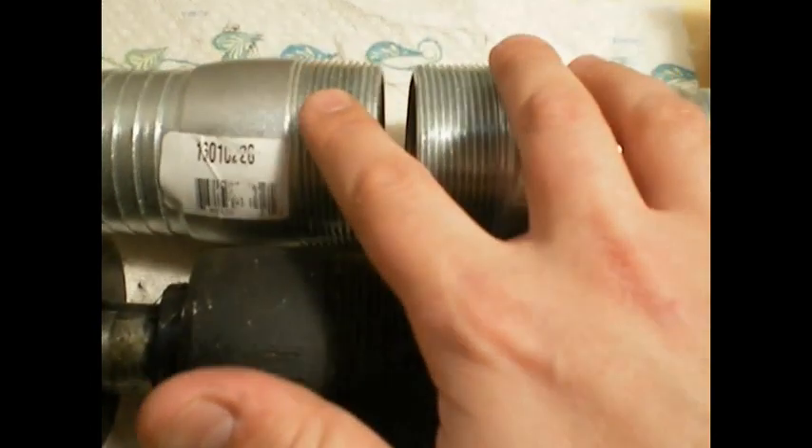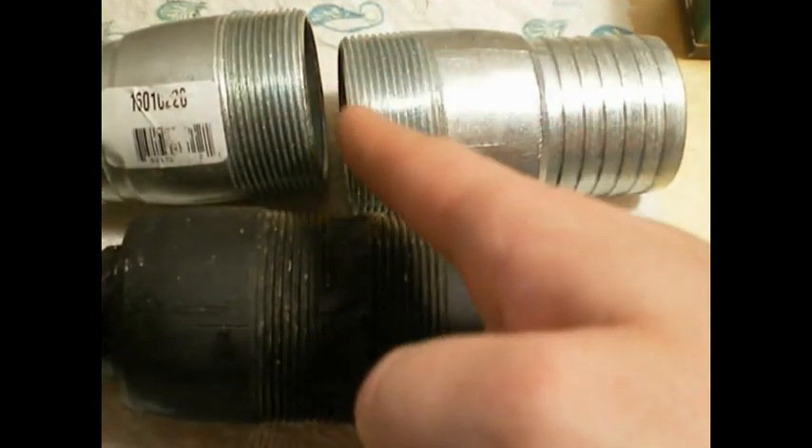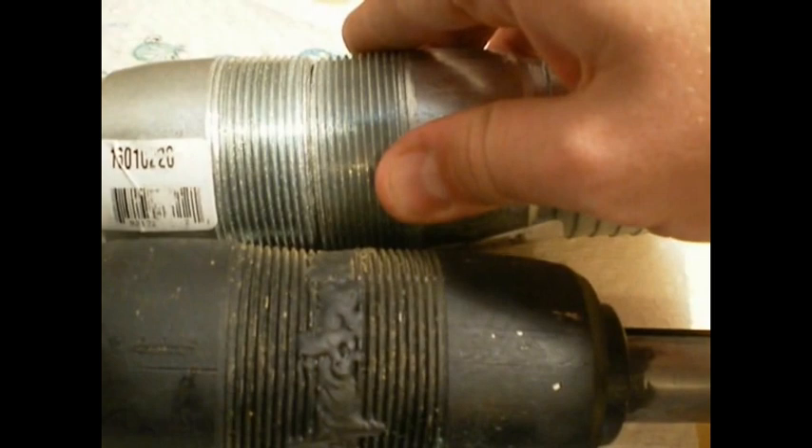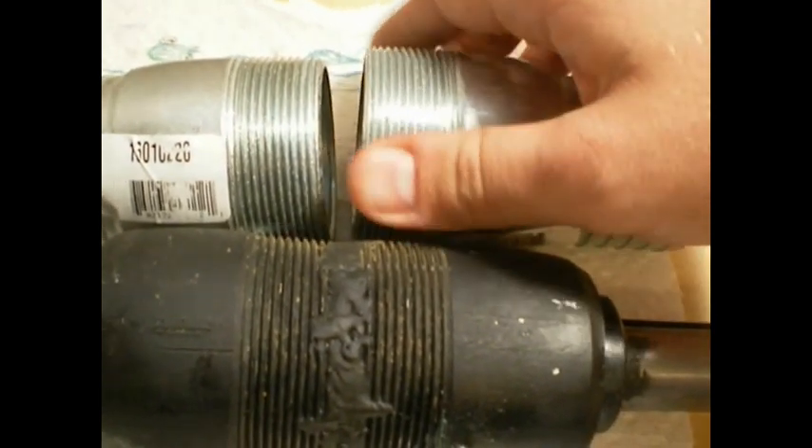If you look at these two-inch galvanized pipe fittings, that's what it looks like — you can see I did cut off here, maybe a little bit in the center, and more or less welded into place. Before I did that I took these bearings and put them on the shaft. And if you take your keyway here and put it inside and weld the keyway into place and match it up just right, these bearings are not going to move at all — they're going to be really stable inside there. The keyway is inside here, and I put these both hooked up together and it just fit perfectly. Nothing moves in there. Once that's connected I welded everything around, and this whole bearing doesn't move side to side at all.